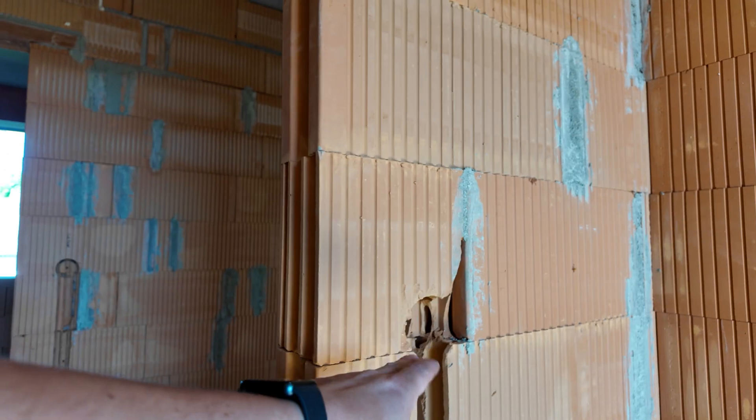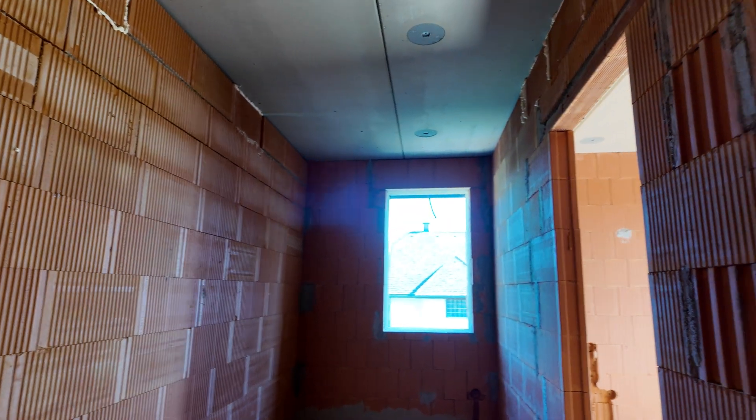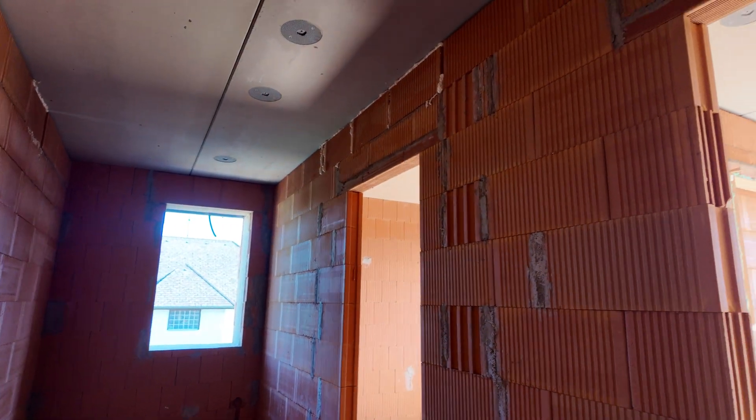Then we have the bus cable from the touch. The push buttons in this floor will all be connected from one to another using bus topology because there is nothing else. All the presence sensors are mounted in the concrete ceiling so we don't need so many cables running back to the cabinet.